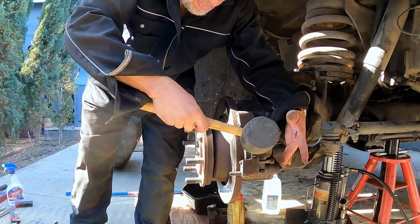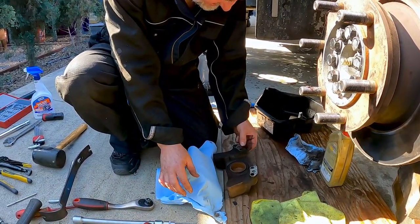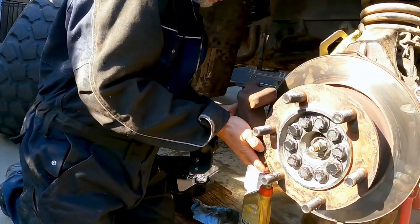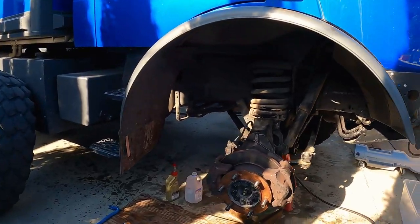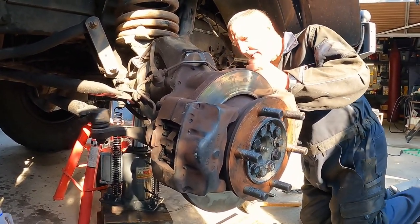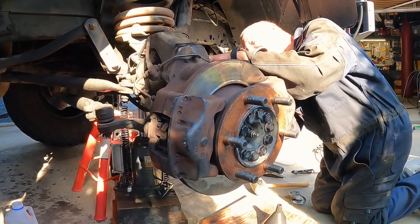These things are way more dangerous to work on, that's for sure. Luckily Chad spotted the absolutely critical little rubber washers - your friend mentioned those too. They're obviously easy to miss but they didn't get past you. We have put on the brake calipers, new brake pads, springs - the pins went back in the same way they came out. That was non-eventful. We then bled the brakes, which was also non-eventful - very simple. I'll get into more detail on that when I bleed my own brakes. Look forward to that video.